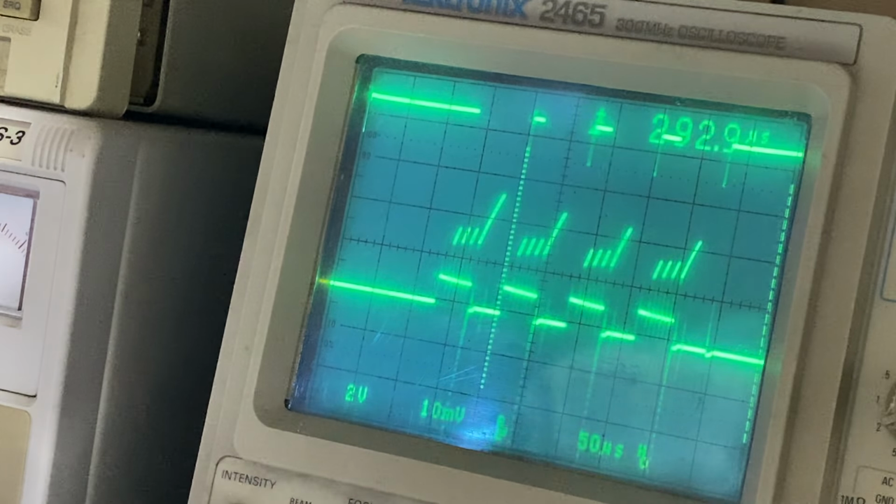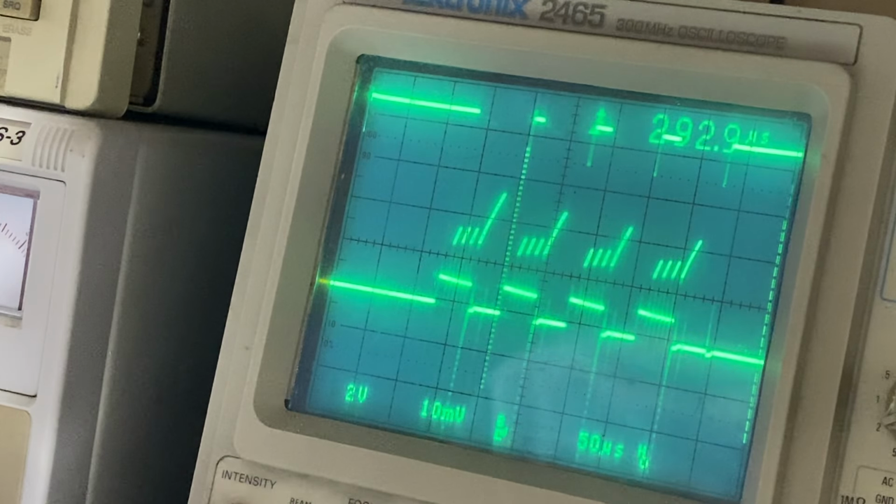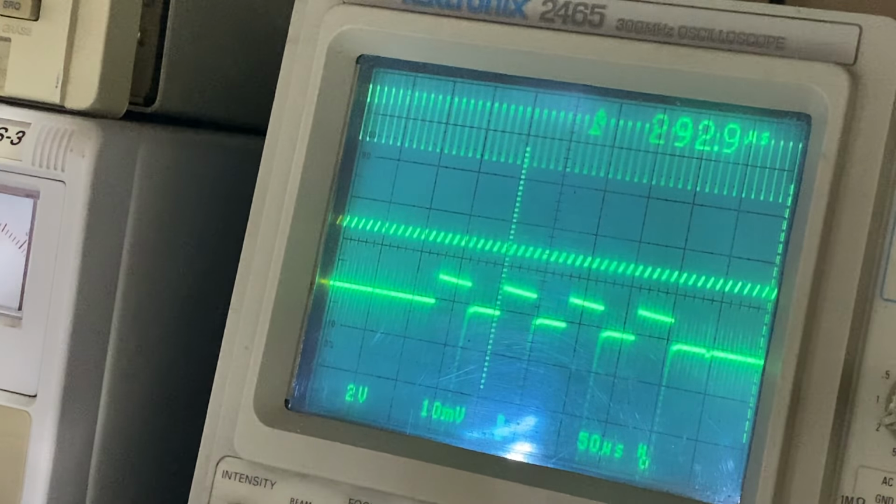to snip where I soldered to that transmit totem pole connection, which is the one on the side of the detector closest to the coil plug. If you get muddled up, it's the front one. So anyway, I'm going to cut it and have a look at the waveform. 1, 2, 3. There you go. That is the power supply running right through transmitting, receiving, dead time, everything.